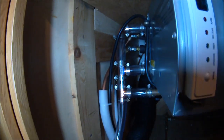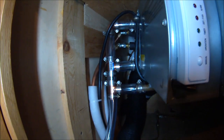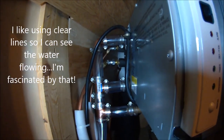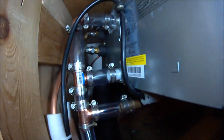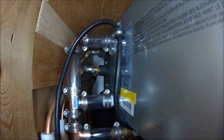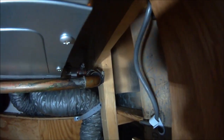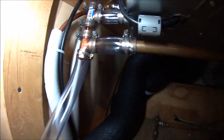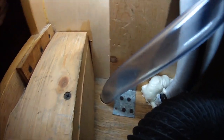So the last thing is this ridiculous looking thing with all of these hose clamps. Turns out that it's like 3/4 inch copper pipe size for the OD on their fittings, so it's about 1 inch actually ID on the tubes. So I got this plastic tube to match the size of the outputs for the evaporator here. And the top one is the pump that pumps the water out. The bottom one is the drain toward the front, and then there's a tube, some piece of junk that I scavenged, that goes to the other side. So if we're tilting toward the back, it'll go out this one. If we're tilting toward the front, it'll go out one of these two, and hopefully there won't be any water inside the bus, and that just goes down through to the HVAC compartment.